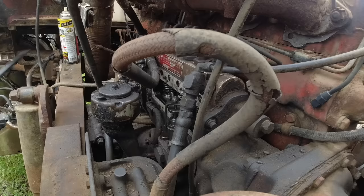All right. Yeah, he says whichever way is easier. If you roll the pump over, say, one hour, and it doesn't ratchet over a lobe, you're fine. Or if you turn the engine. Okay. As long as you line those up, you should be good. Oh, perfect. Okay. All right. Cool, man. Well, I appreciate it.